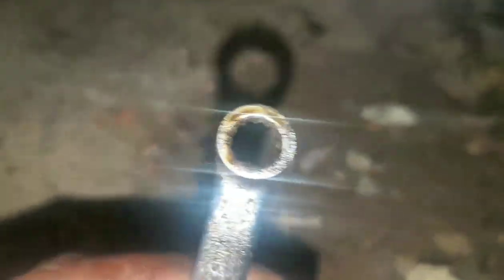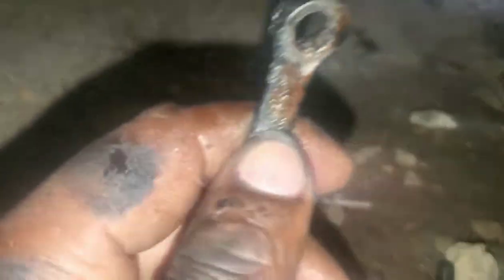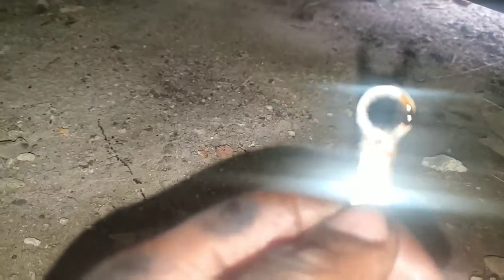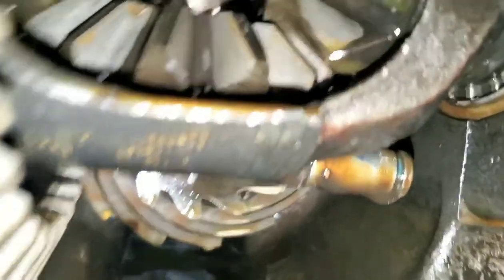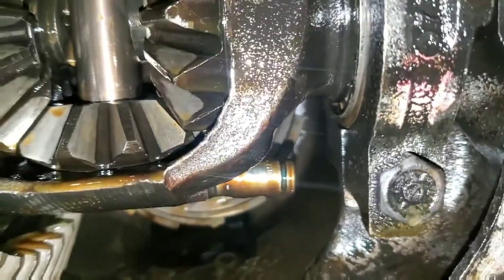Why in the blue hell did they decide to make a 12-point wrench? Why stop making 6-point and make 12-point? 12-point does not have better grip — 6-point does. Because with a 6-point, you have two contact points covering all edges. With a 12-point, you have one covering edge and one tooth on a flat edge, which makes it strip. Now I've got to specially order an 8mm, and I have that far to go to get it.